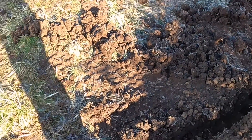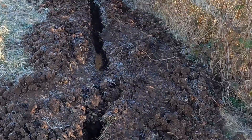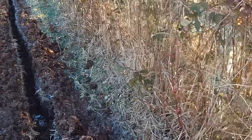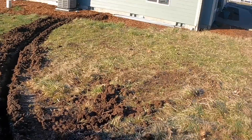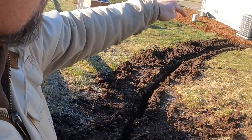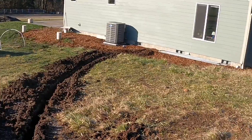I'm going to pack some dirt back in here to help dam up where the water is coming through in that direction. Still got to clean it out and pack down the bottom. All this right here is just spring water or groundwater coming through. I'm okay with capturing it going to the curtain drain and out — I'm just preferring not to have it going the other way as much as possible. Eventually I'm going to have a retaining wall back there with a drain that'll tie into that drain and feed out to daylight.